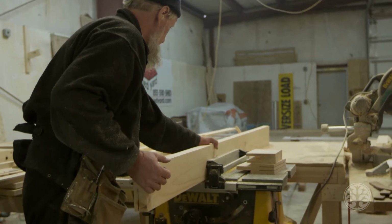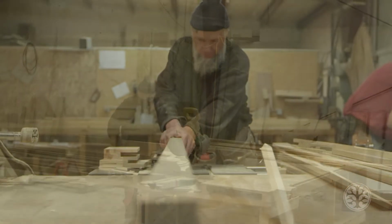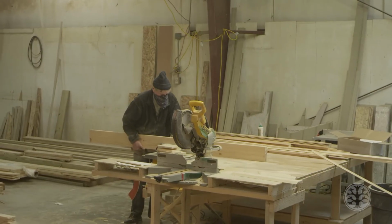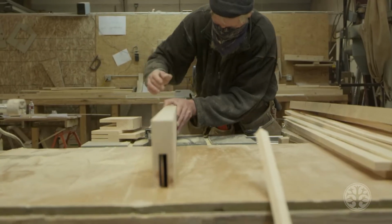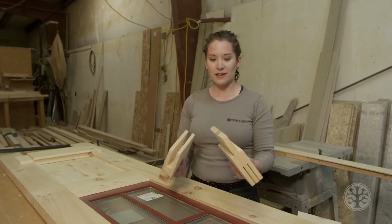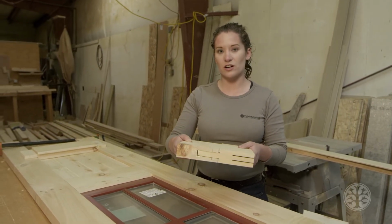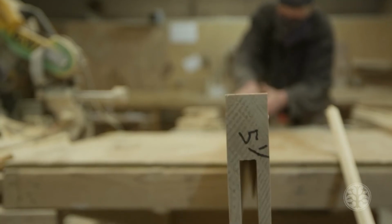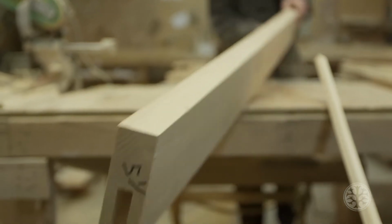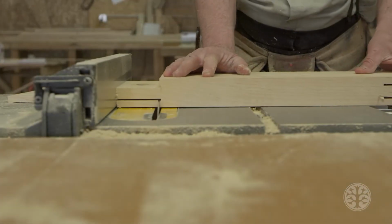of building this door. He's actually built this as a mortise and tenon construction, and what that means is that he has taken the saw and he has used 1 block of wood. This would be the mortise, and this piece here is the tenon. And they fit together very nicely like this, and they create a very strong joint. Now, Pop Fisher used to be a cabinet maker, and so this is one of the methods that he would use on his cabinets. So he has actually taken that and applied it to this door.